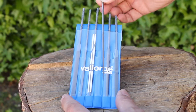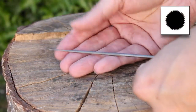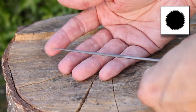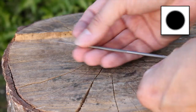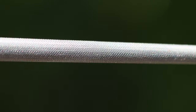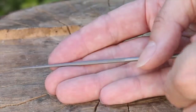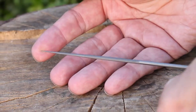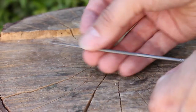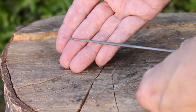If you've ever wondered why they're called needle files, just look at this round file — it's fairly obvious. This is about 2.9 millimeters in diameter with a circular cross-section, and the teeth are all the way around it, 360 degrees, cutting towards the tip. As you can see in the close-up, the teeth really do go all the way to the tip. This is great for getting into tight, intricate areas like inside jump rings or inside clasps. Because it's round, do be careful of it rolling off your bench — if it hits the hard floor it could get damaged.